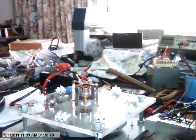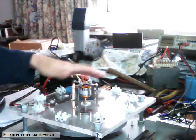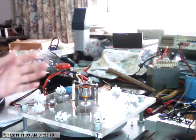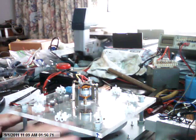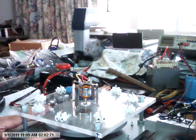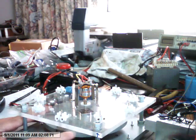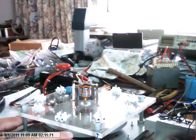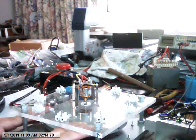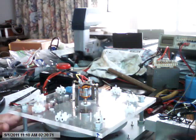I noticed there's been a few other videos on YouTube using a similar setup. So I'm hoping to take this to the next level because you can see I haven't actually got any coils in place at the moment — I've taken out all my old coils. At the moment I've still got the big 20mm magnets in place on the rotor. I've had a few instances at high RPM where some of these little Neos come flying out. These are the whole Neos — I'm going to remove them. I obviously don't need them anymore because we don't need to drive it that way.